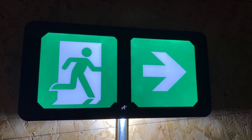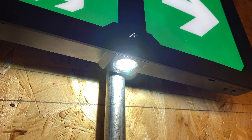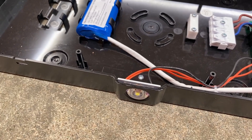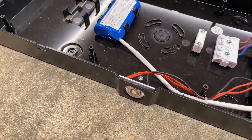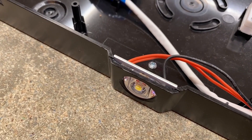The exit box version has a slightly higher power consumption than the exit sign because of an additional LED here that provides some of the illumination you'd need for the escape route — illumination that in some installations you would previously have had to fit an additional unit alongside the exit sign to provide.